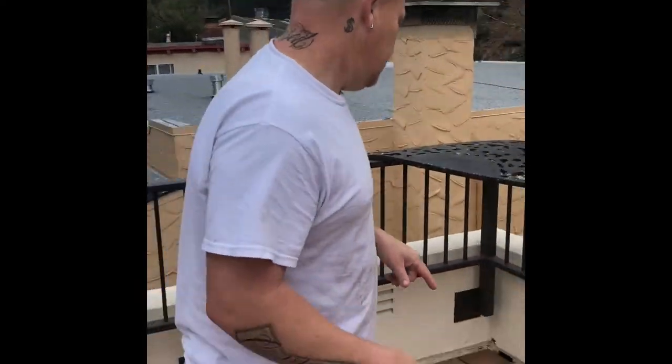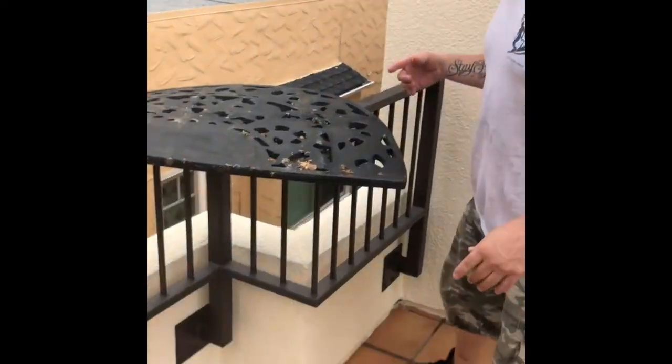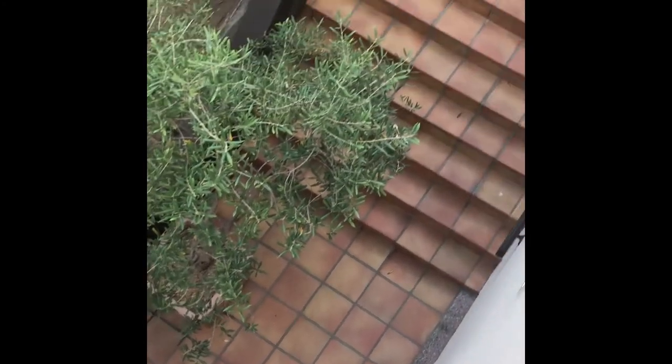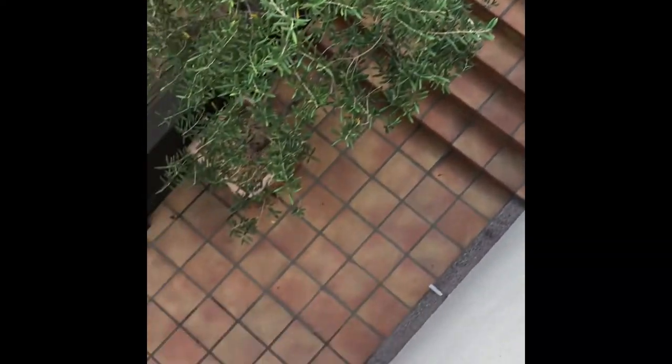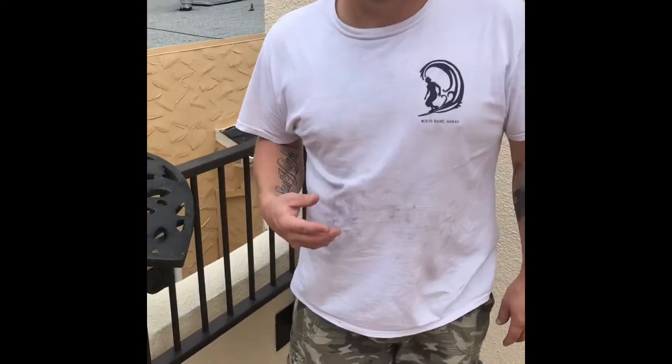The purpose of the video: make sure your tile setter's giving you the perfect pitch to your drains. Make sure you use common sense and don't put a drain this small — one leaf clogged it up. The good thing they did do is if you come over here and look down, they put it so it drips into this gutter and then the gutter goes all the way down, and they ran a pipe all the way out to the street. They did not let the water drip onto the tile down below. That's something else you'll want to think about — water from gutters. Those guys convincing you to let it drip down onto the other tile: all that stuff over time wears away your grout and starts to create water damage.